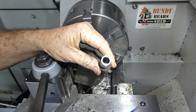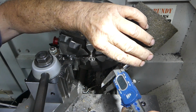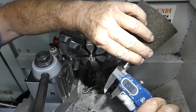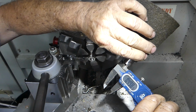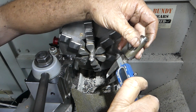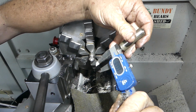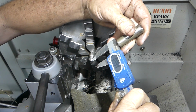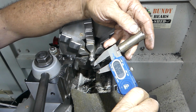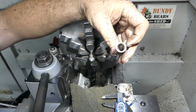So the other thing I'd just like to check, and I think it should be right. So we've got 0.5, we're half a thou big in the bore, that's just lovely. We're happy with that. Yep, there we go. We've even got a parallel hole. How do we do it for the money? Okay, I'll tidy that up, then we'll give you a look.